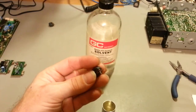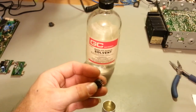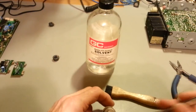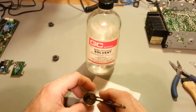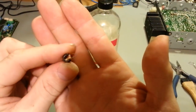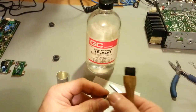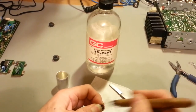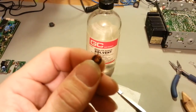With the GC Electronics Radio and TV Cement Solvent, the way I actually got the glue off was soaking. This was my first experiment — I put it in there for a while. It was really thick so I pulled a bunch of chunks off with tweezers first, then just let it soak for a while. I grabbed a stiff bristle brush and — surprise — once you let it soak, you can just brush the glue off, even from deep in the windings where there's no way you'd ever scrape it out without damaging the wire.